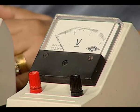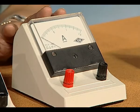There are digital meters available as well. Those do not work on this principle. Many labs have them now, but it is not necessary to use a digital one. A digital meter is the type that an electrician brings to your home, puts it in the circuit, and reads off just the numbers appearing on it — it tells you how many amperes, how many volts. Other than that, you also have a multimeter, which combines the application of this and the device to measure resistance. But in normal practice, separate meters are used to take the values of current and voltage.